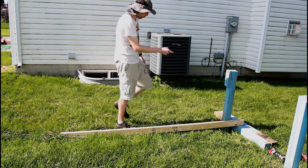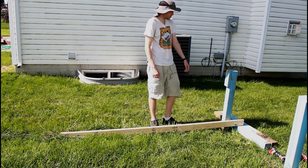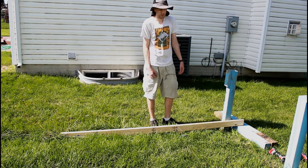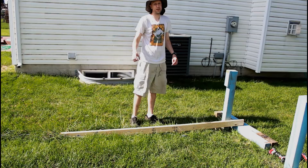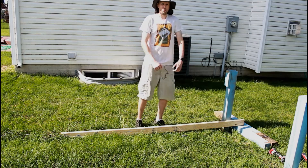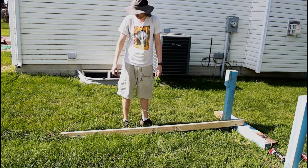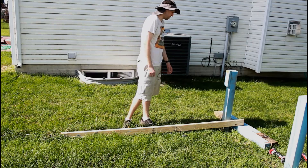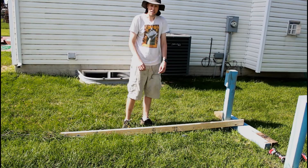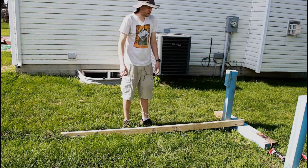So we've got our lever in place — the fulcrum a tenth of the way out and our effort force all the way at the end, giving us a 10-to-1 force. Let's assume I can lift 500 pounds — probably not a good assumption — so maybe 100 or 150 pounds of force. Multiply that by 10 and we're into the thousands of pounds of force. If the screw holds we should be able to make some pretty good progress here, but that's a big gap so we'll see how it goes.